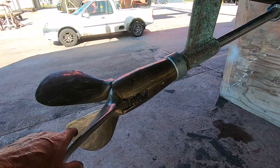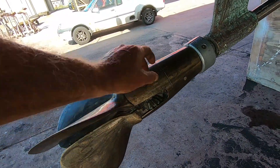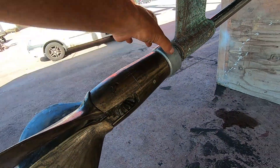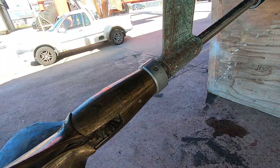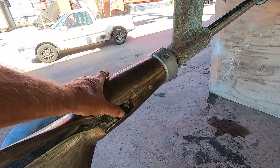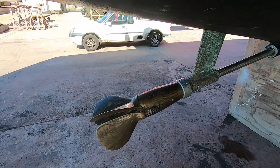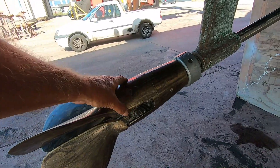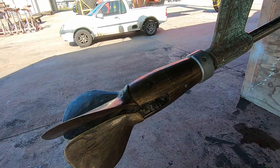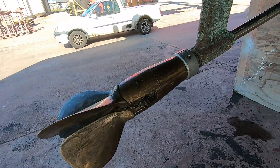It's quite incredible little pieces of machinery. Amazing — you can just take that collar off and pull the whole back section of the prop off without taking the actual sleeve that mounts onto your shaft. That collar just turns off and slides forward and then you can remove the whole prop and replace the back section. He's taken the blades off and dry mounted them back again just to see how they go. Pretty simple — just keep your head and keep the parts numbered in the right place.